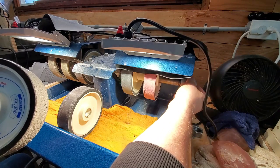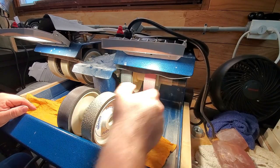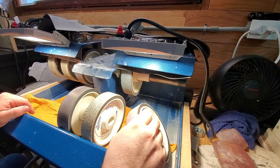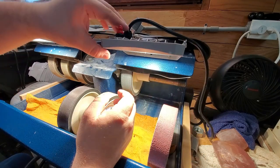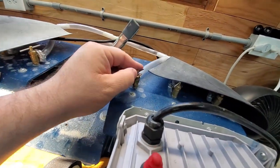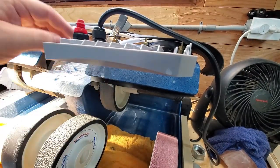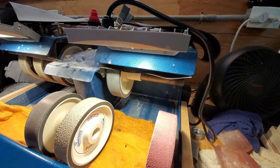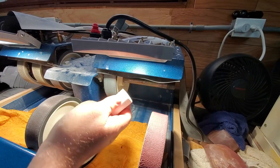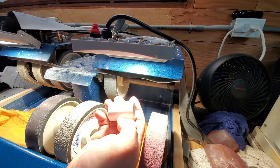Need my spacer — those are important. I should bring up, since I already have this taken apart, that spacers are actually very important for this machine. If you look up here, I have these drip lines which control the water flow. I have it set up so I can make my own spacers. I just take some PVC cutter and some PVC that will fit onto this, and it makes actually very good spacers — it's super easy to do.